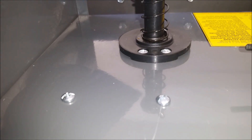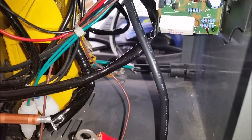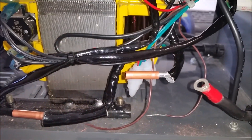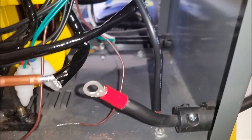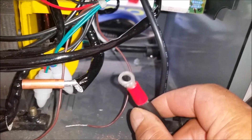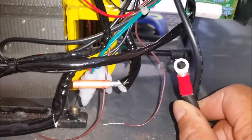This is what it looks like with the bridge rectifier mounted — that's where I'm putting it up here. I positioned it and drilled holes from the top. I brought the other transformer output from the other side back around to this side, so both outputs come out and go up to the bridge rectifier. Then your plus and minus come out down to the capacitor. Plus and minus — just remember, don't get confused: your clamp will be your positive.